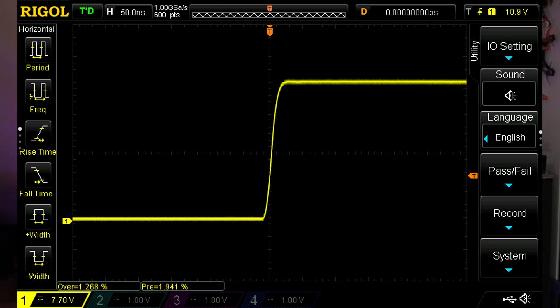Now let's go to the thin coax cable. How different can it be from a regular wire? Look — there is no ringing. The signal takes some time to settle, but it's not really overshooting the target, at least on D-Shot 600. On D-Shot 1200, there is some ringing but not very much — it looks almost perfect. Multishot 4kHz shows very nice traces. And Multishot 8kHz is similar to D-Shot 1200 — definitely much better than anything else we observed today.